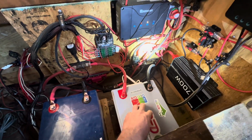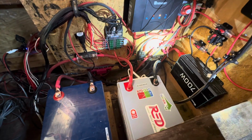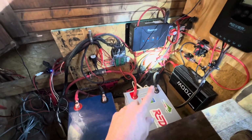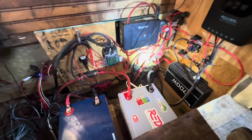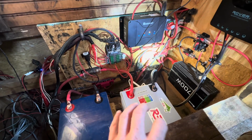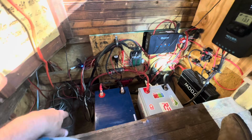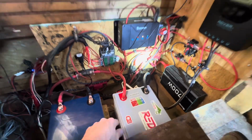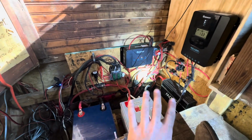This one does have a temperature cutoff on it, which is important because unlike this one, it don't like getting cold, and bad things happen when these things get cold. Our charge controller has a thermostat that connects to this area as well to monitor to make sure it's not going to be charging it if it's too cold down here. And I can even route heat into the basement if need be, if we need to get these batteries up to temp. The way this is all wired in is actually 2 different circuits as well.